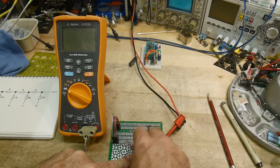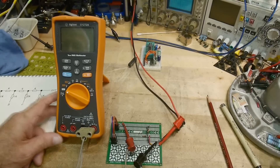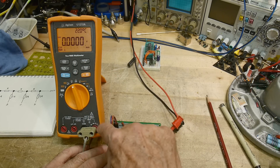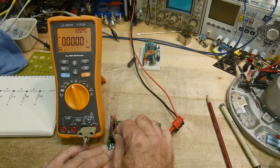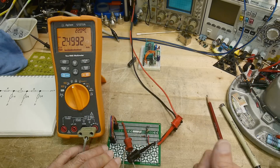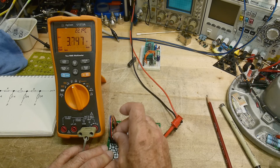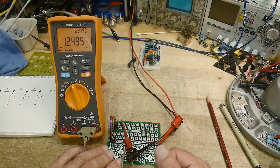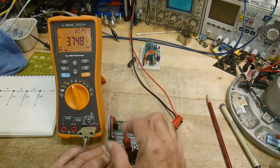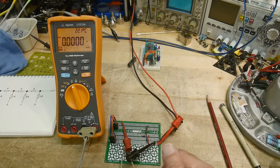The output is over here, and here's ground. We'll turn on our voltmeter. So we've got zero volts because everything is zero. If I move the D voltage up to plus V, I'm getting two and a half volts — which is half of my input. I'm putting in five volts into the board, so I'm getting two and a half volts out by strapping that one. Let me strap this one and put the other back down to ground — I get one and a quarter. You can see this is kind of a geometric thing.